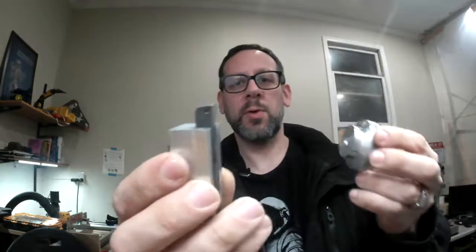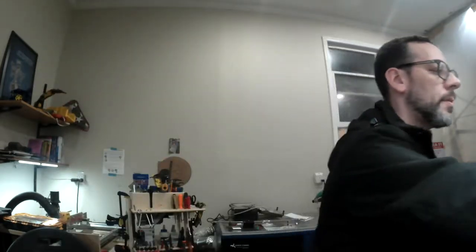So we're gonna machine, out of a solid bar of aluminum, our own hand wheels. We looked at most of the lathe operations that are gonna come into play here. Two new ones that we added. I added a right hand cutting tool. So this guy right here is just coming in little by little and pulling off material. So that's what I used to carve out this side.